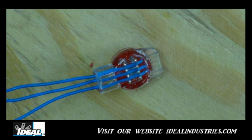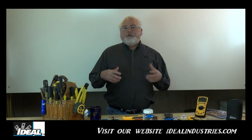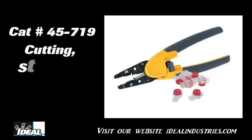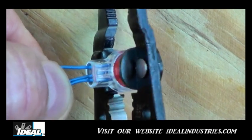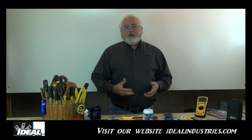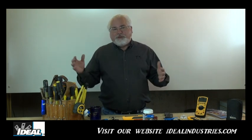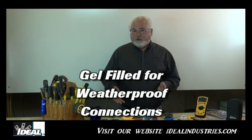You can put multiple IDC connections together inside a single connector, and that's essentially what you have in these jelly bean type connections. You simply take all the conductors you need to tie together, insert them inside one of the jelly beans, and then use the 45-719 crimping tool — which also strips and cuts the wire as needed — to crimp the connection down and make them all one. You could use a basic pair of pliers as long as you don't crush the connection, but having the right tool is always a good thing.